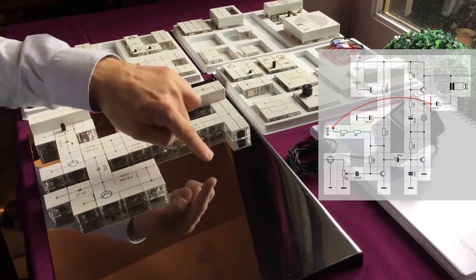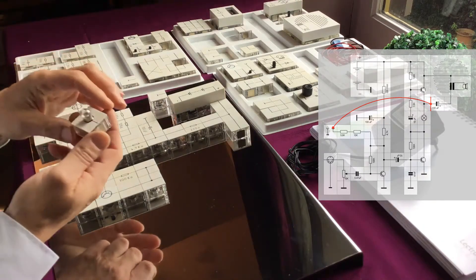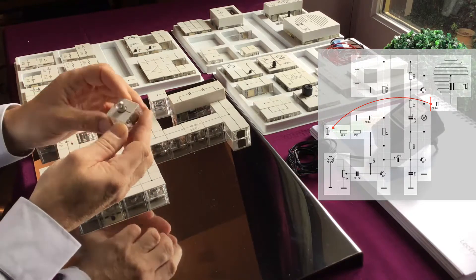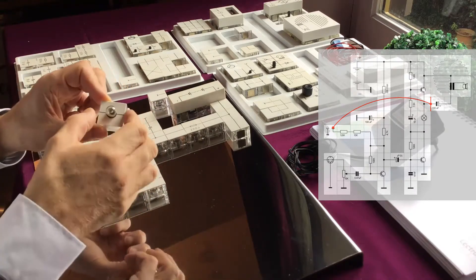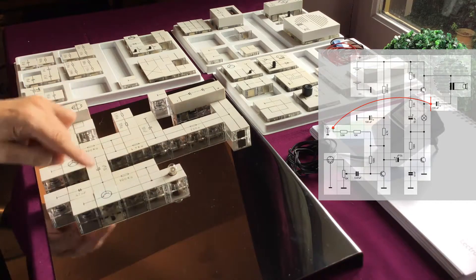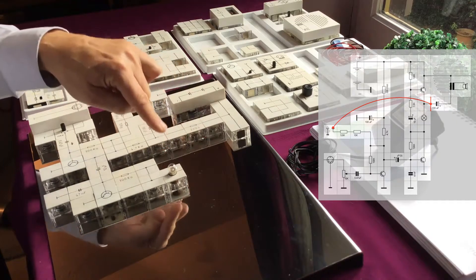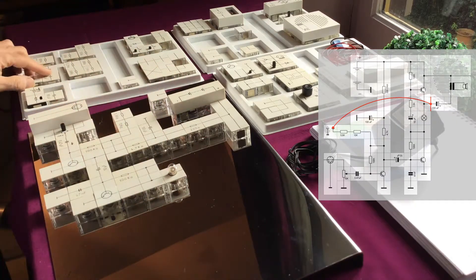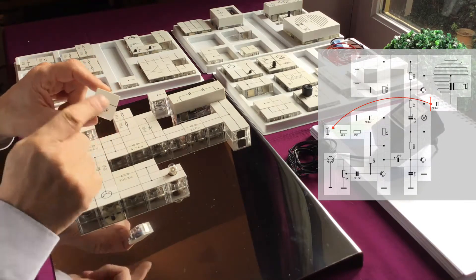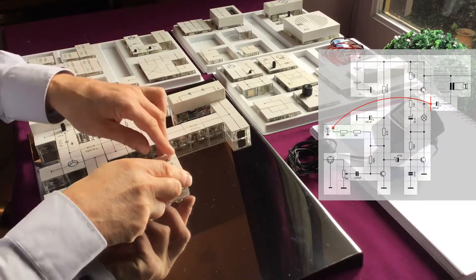This will continue to the next stage. This time we are using the lamp — the lamp is only used as a small resistor. To couple our second transistor to the third transistor, we need a decoupling capacitor to separate the power supply. We use the 10uF capacitor, and pay attention to the plus. We mount it this way.